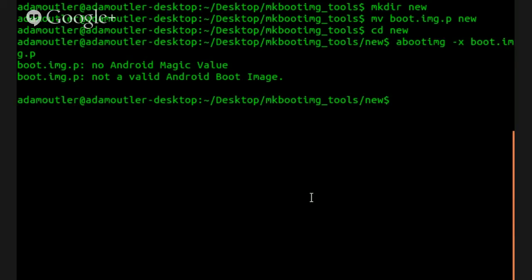So what now? Has Samsung released some source code? Well, even if we had source code, we don't have the RAM disk. You don't have to have their RAM disk. You can supply your own RAM disk. It might be a bit of a guessing game to figure out all the proper addresses, but since you've got UART access, we could probably get that from the UART logging, or at least figure out which one is wrong and try to fix it. But we need the kernel source. Yeah, there isn't any kernel source available for this yet.